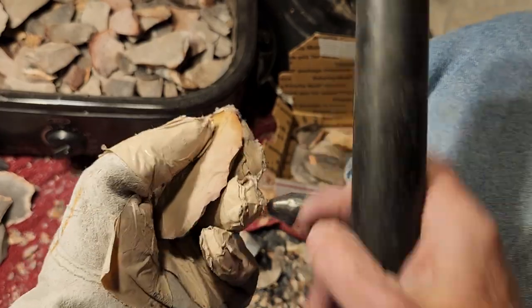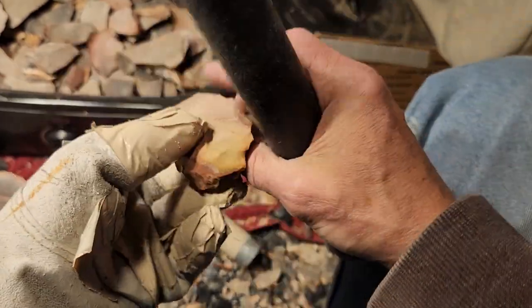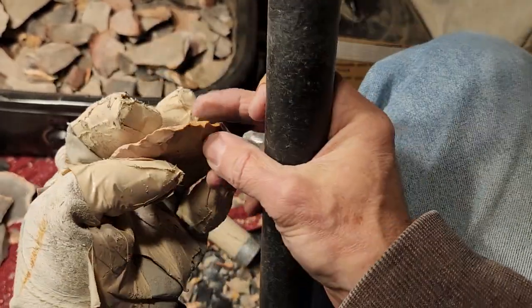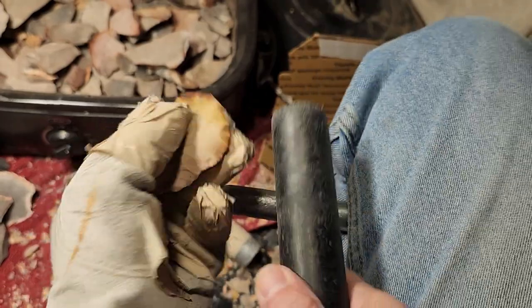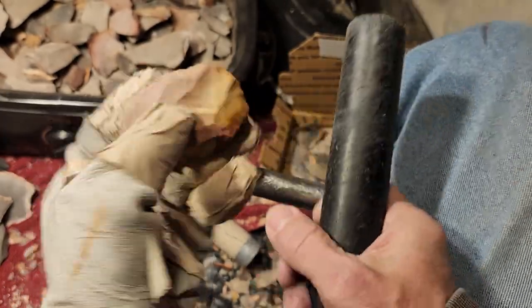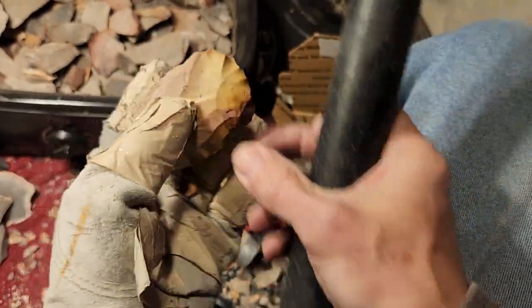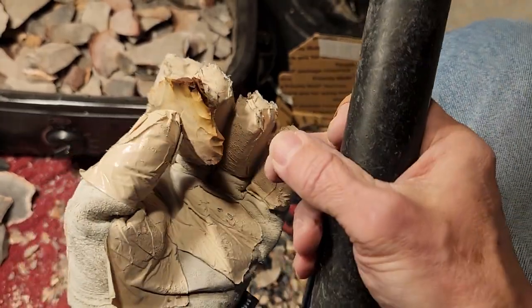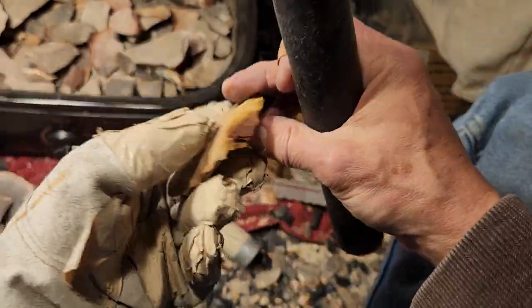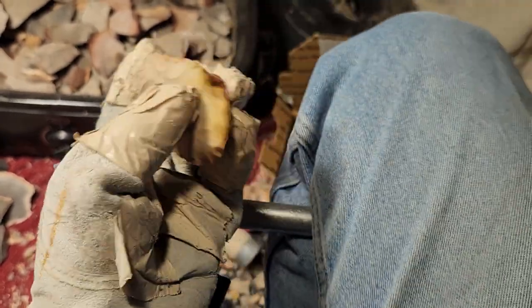But remember, I don't use a pad in combination with my indirect punches. With my horizontal indirect, I don't use pads to back it up. The only thing I have backing it up is my glove, and I try not to interfere with the flake travel. I don't pull or support with the gloves in any way. I just hold it where I'm knapping it, not gripping it tight. I'm using the weight of the workpiece against itself, even in a small scale like this, by striking fast.